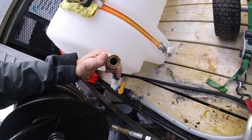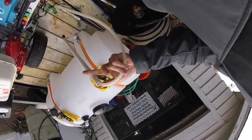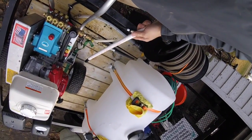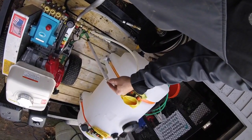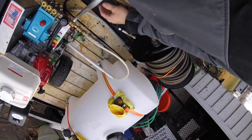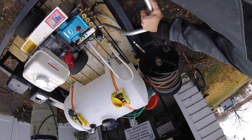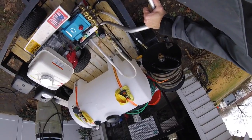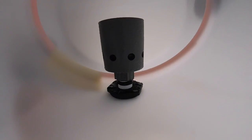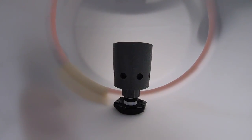My high pressure hose will connect here, or it'll go to my inline draw hose. This sits in my bucket — I just use a five gallon bucket and put it right in. I mix my chemicals up in there and this will draw with low pressure. I do a lot of low pressure wash because I think that's a lot better for customers' siding, and it's just easier to make sure the chemicals are doing the job as opposed to the pressure. I have a shut off valve that once the water gets up to that height, it will shut itself off.